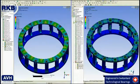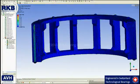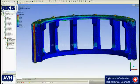Another important issue is connected to the equivalent stress evaluation in both types of cage. In the rivet type cage, due to the higher deformation in the rivets, the equivalent stress will present a maximum value of 760 MPa. For the AVH execution, the maximum equivalent stress is only 348 MPa. Because of the different deformable area section and material, the rivets will present a stiffer behavior due to the mechanical properties of the steel they are made of, meaning that they will have higher internal stresses.